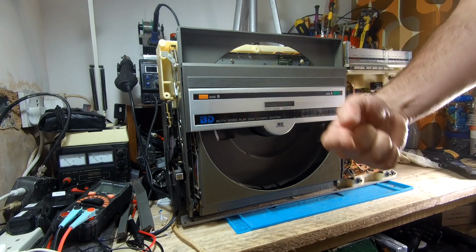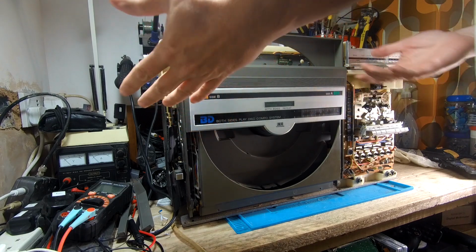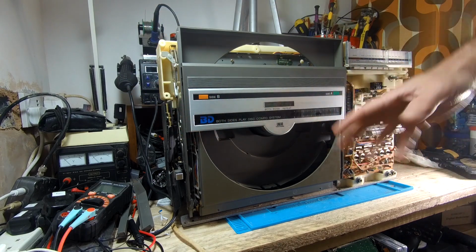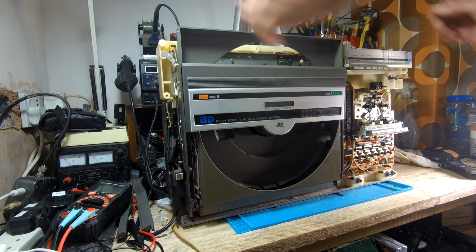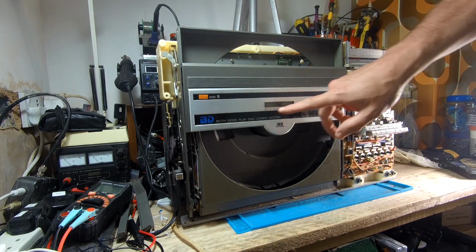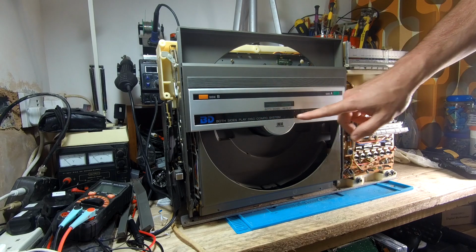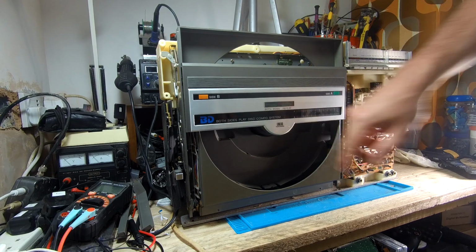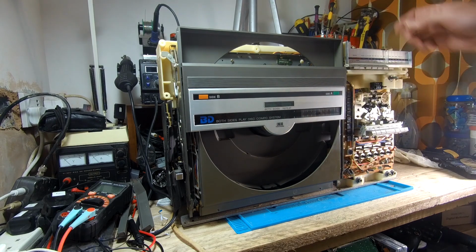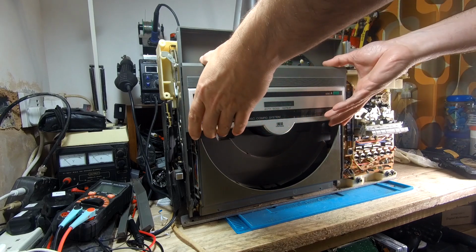Right, so I'll probably be using this front camera for most of this, maybe a bit of the overhead. Firstly, when we was checking this before, our disc light isn't working. All our other lights, both sides repeat, side B, side A, are working. Our needle light is working, but the light down here for the disc isn't. So what we need to do is get this front part off. I have already loosened it.